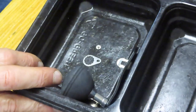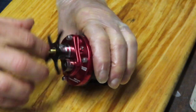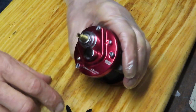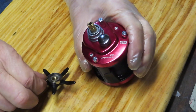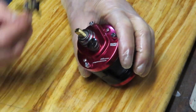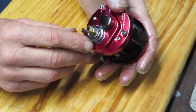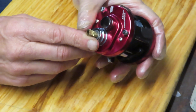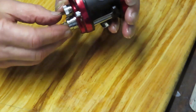All the pieces and parts I take off go into a parts tray — it's the bottom of a fast food container — and it helps me to locate all of the pieces when it's time for reassembly. I also take pictures along the way and I recommend that you do the same. Those pictures are invaluable in helping you determine the orientations of the parts and how you took them off so that you can see how they go back in. Use your cell phone, a digital camera, or take a video.